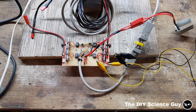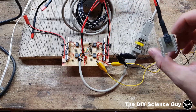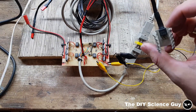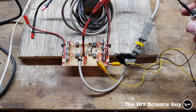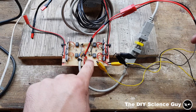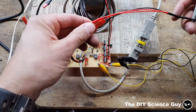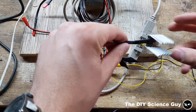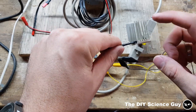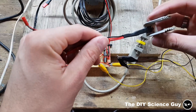As I was filming, the voltage control transistor burnt out from the light intensity sensor because it got way too hot — I didn't have a heat sink attached to it. And because it's very hard to remove, I now attach these wires with connectors so I can easily remove it if it goes again. And now I've attached this heat sink so it won't get as hot, so hopefully it will keep working this way.